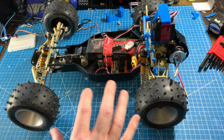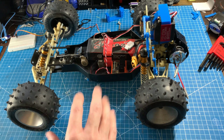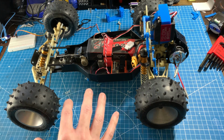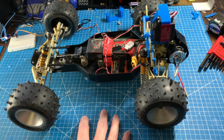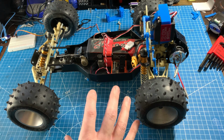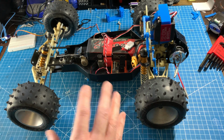Almost all of the so-called active suspension systems on production cars today are actually considered semi-active suspensions. The simple way I differentiate a semi-active suspension from an active suspension is that a semi-active suspension cannot add energy to the system. That means it can only vary how much a damper resists movement. There are three main types of semi-active suspensions.